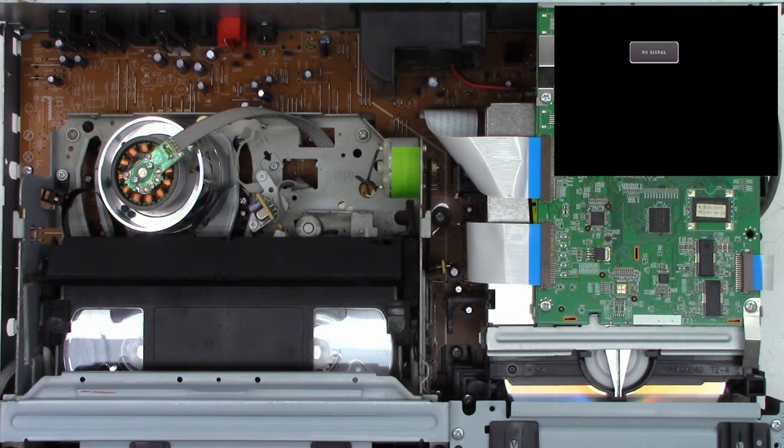So, 0.16, 0.17 on a 470. That is perfect. I think I checked this one already, 0.1 on a 1000. That's the one that's just ever so slightly high. Checking the pad, no resistance, and the capacitor reads 0.5 ohms on a 22.